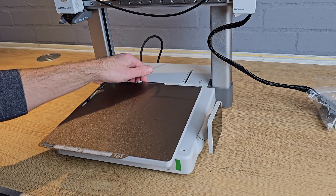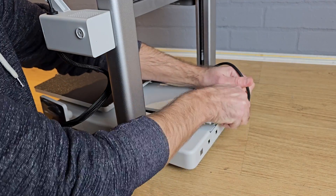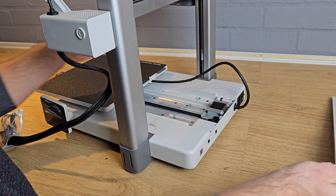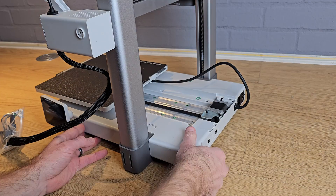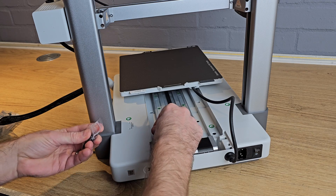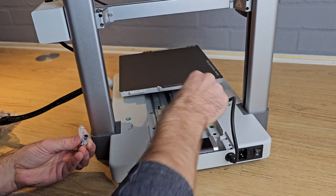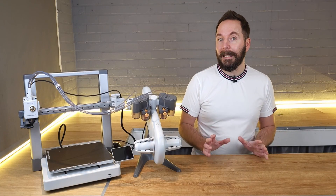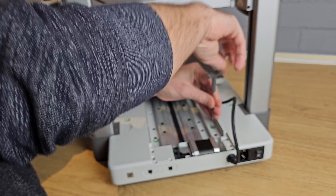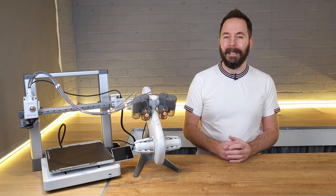Slide the heat bed all the way to the front of the printer and turn it round so that you can access the rear, then remove the cover in the centre of the rear of the base. This cover initially pulls straight up but then slides back so that you can remove it fully. You now need to find the bag of screws labelled for base housing and insert them into all the visible holes that have a green ring. There are two holes that are under the base, but leave those for now. Tighten all of the accessible screws, being careful not to crank them up too tight — just turn them clockwise until they stop without forcing anything.